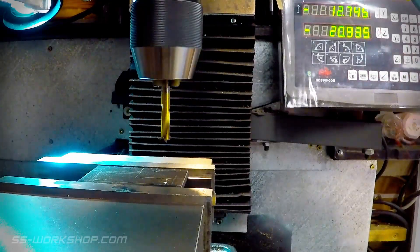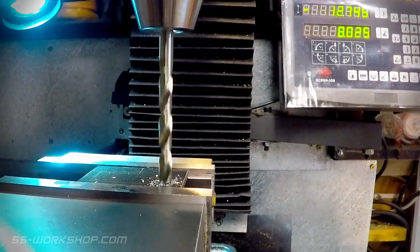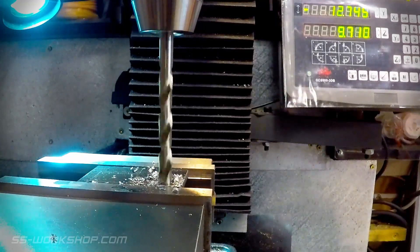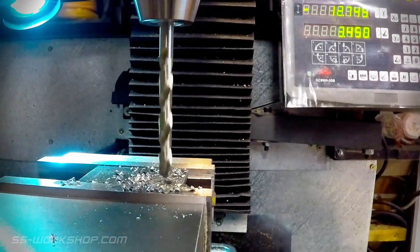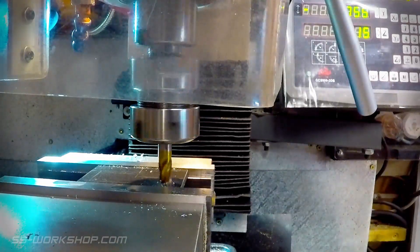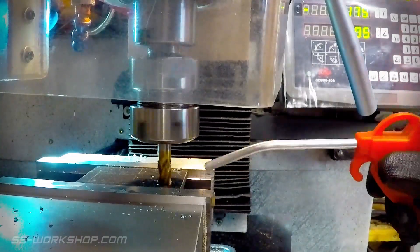The tack is complete, so it's off to the mill, where I drilled a 10mm hole as a start for an endmill. With the 10mm endmill, I cut the central opening in the plate, using the digital readout to accurately locate the opening.